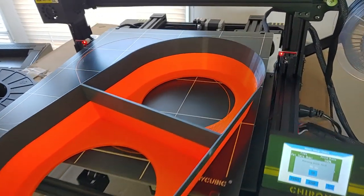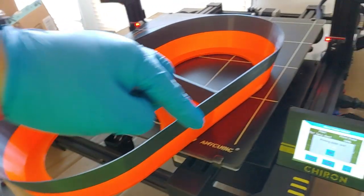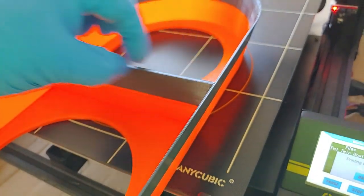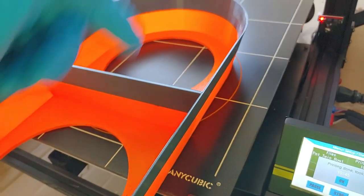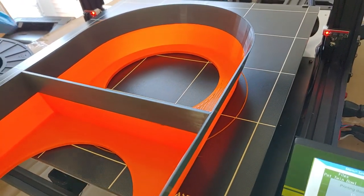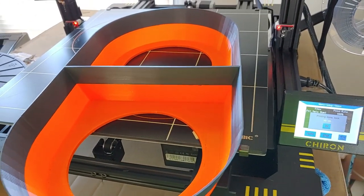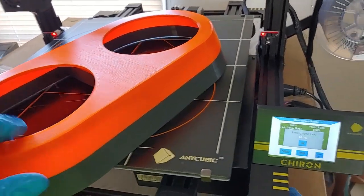As you can see, it's vase mode, and you have this two-layer path that comes in here to allow it to complete the vase mode circuit. It comes in back and continues the circuit. That cutout slit stops 1.25 millimeters from the wall so it doesn't connect, creating two different islands. The gap is 0.2 millimeters wide so it has a valid vase mode path that allows it to install this reinforcement without breaking vase mode. And because the gap is basically zero it still melds together, especially since I'm running the vase at 1.25 extrusion. Prints in five hours, nice and strong.